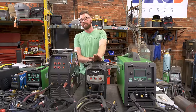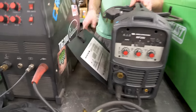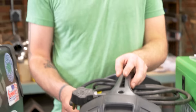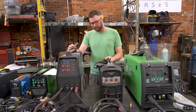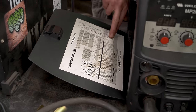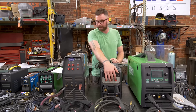As far as complexity and learning curve is concerned, this is not the easiest welder to dial in. The numbers on the dial don't really correspond with the numbers in the chart — the numbers in the chart refer to the analog numbers on the back plate, but there are digital readouts above these. I'm a big fan of using the included charts. If some manufacturer has bothered to write out all the settings for a certain wire thickness, metal thickness, and type of gas, most of the time it's a really good starting place. I find myself looking at the numbers behind the dials rather than the digital readouts.